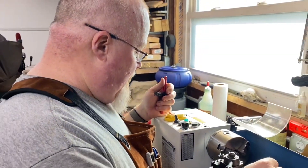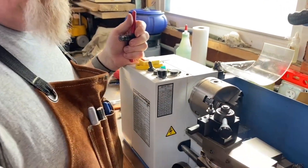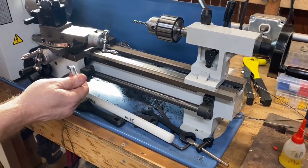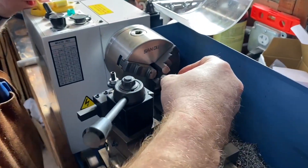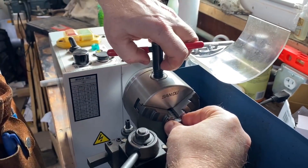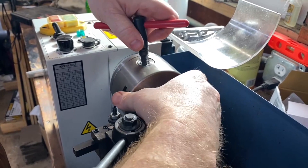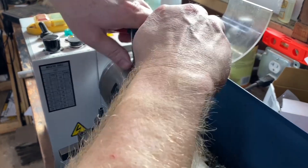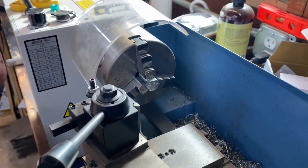This is my mini lathe. I got this from littlemachineshop.com — a really handy place for mini lathes. I know a lot of these are imports from China, but this is one of the better quality ones they have, and I find it useful for nice little projects around the homestead. We're going to put the bolt in here, being careful not to booger up our threads. We've got the bolt in and we're going to tighten it in our lathe. You don't want to go crazy, but just make sure it's nice and snug. There are three jaws on this one — you can also get a four-jaw, but I only have the three-jaw right now.